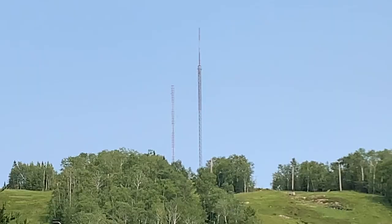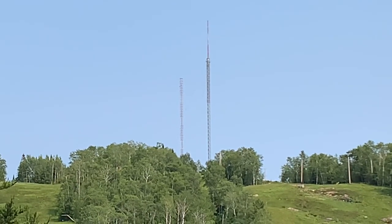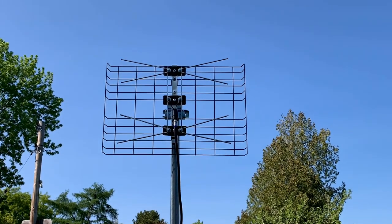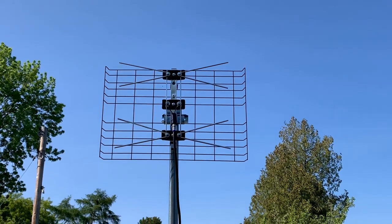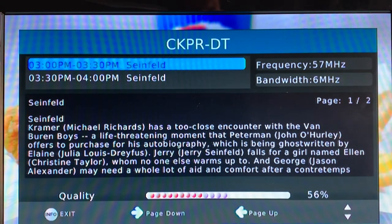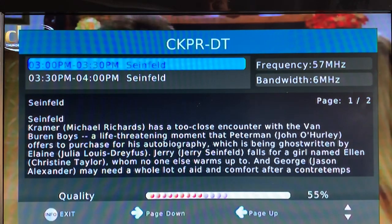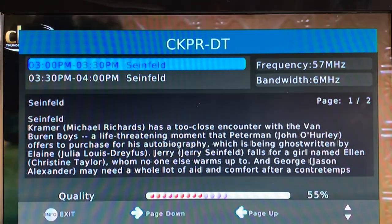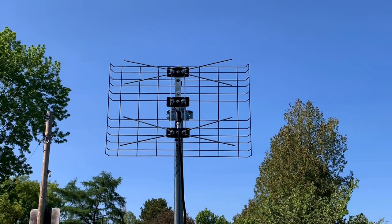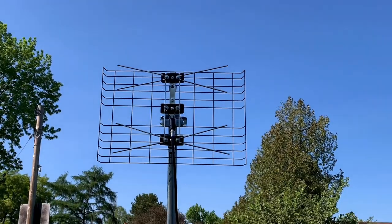What this test means is that if you live in an area with strong signals or you're close to the broadcast towers, you can probably get away with using a small antenna like this, even one that isn't necessarily meant for your TV band. However, these signals are on the low side, and even though they're locked now, there's not enough signal margin to handle bad weather — wind, rain, or anything else that could cause signal loss. Even though it's fun to test antennas outside their intended use, the best advice is to buy a proper antenna that is meant for your reception situation.